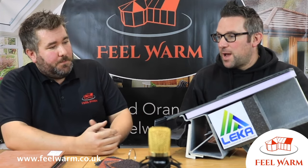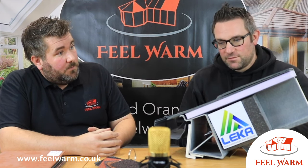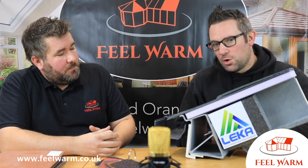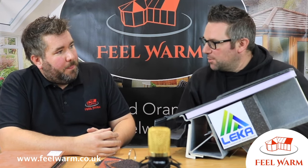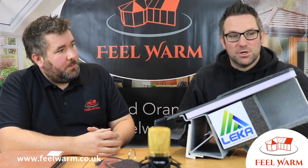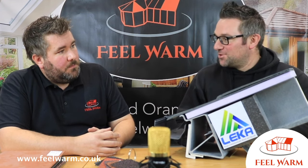Absolutely, because that's what the value is about. Obviously, we've got to consider value in these things, but not at the risk of sacrificing structural integrity. You can't do it, it's unsafe for very obvious reasons. So think about that now when someone comes along and puts plasterboard on the inside, big timber sheets on top, which is probably heavier than the polycarbonate alone, and then they should technically line these rafters with timber to be able to screw the board down, and then you've got your tiles and your lap on top. No way, absolutely no way.